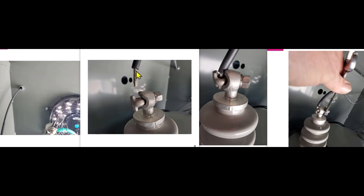Once we get my cable inside the cart here, I want to strip off about 1 inch of the black insulation or gray insulation of that cable so we have bare cable showing. On your discharge post on top of the transformer, there is an eye bolt that has a hole, in other words, an eye on one end of the bolt and a nut on the other. That's a 9/16 nut. In other words, a 3/8 nut with a 9/16 wrench will loosen that. And so you need to loosen that up. That gives you access to the eye opening on the end of the bolt.